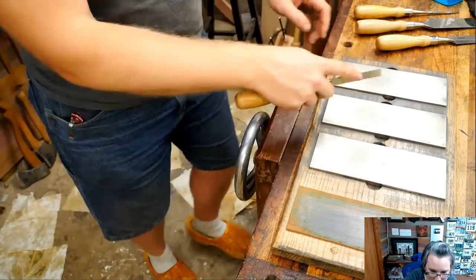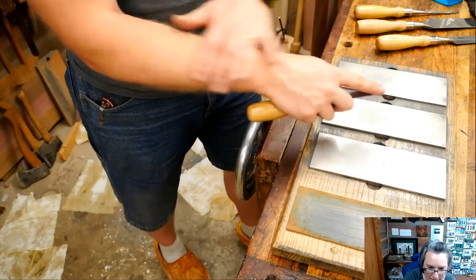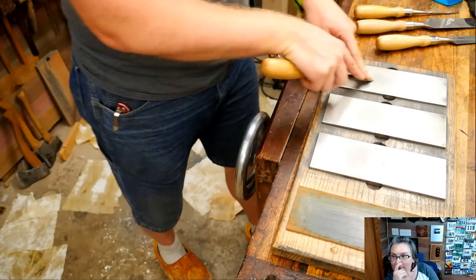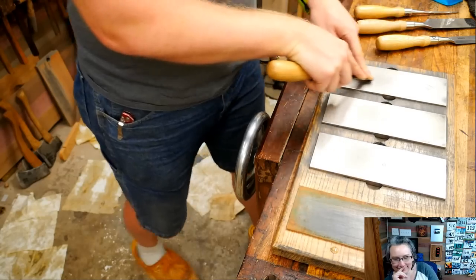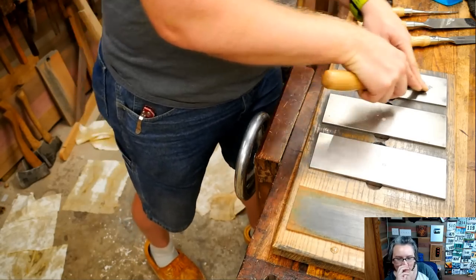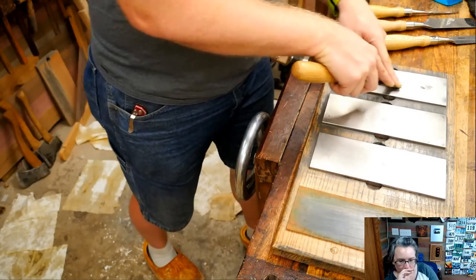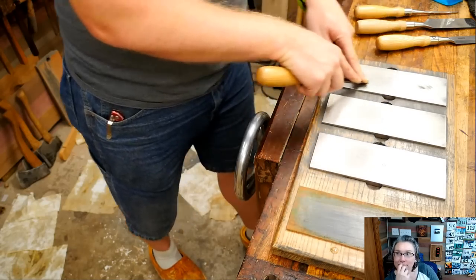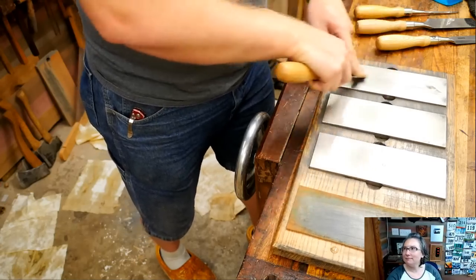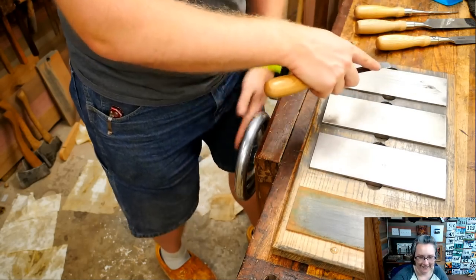And what I want you to see here is a lot of people immediately try doing this with their arms. And what I tell people to do is lock your arms, lock your elbows, lock them to your body, and move at the ankles or knees. And this way you can make sure you're maintaining the angle. And stepping on chips. I really need to get leather soles on these. The Purple Heart is far more slippery. And so I'm just going to be moving my whole body, and that way I can make sure I'm locking the angle in. And eventually what's going to happen is you're going to get good at this and your body's going to get used to it, and you can start to decouple your arms from your upper body until eventually you're just doing this. And so now this is how I sharpen, because I've gotten used to it, I've gotten the feel down, but for the initial learning, it's good to lock your whole body so you're moving at your legs.